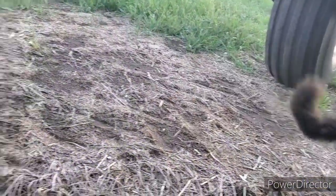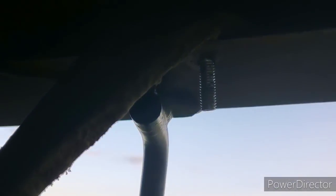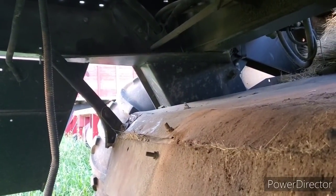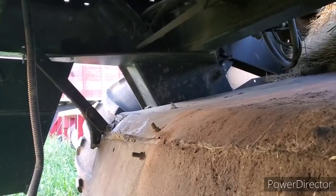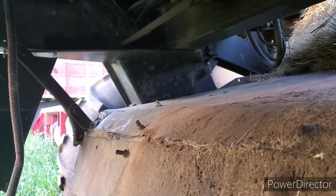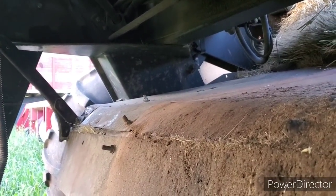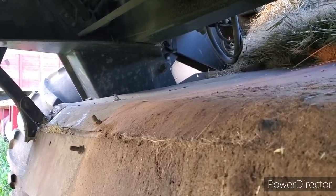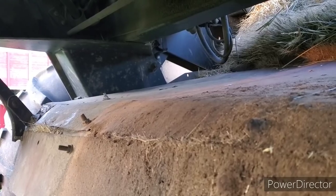Lexi, how are you now? Good and you? Well, boys, we're just taking a break from the old combine there. She's pretty near ready to go. I got to pick up a water pump tomorrow. She's blowing antifreeze out. And underneath the engine, there's two steel lines that go to the hydraulic oil cooler are leaking. So, or were leaking. I got them made up to rubber.